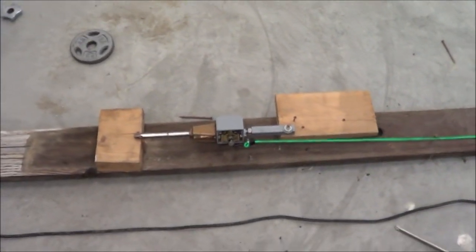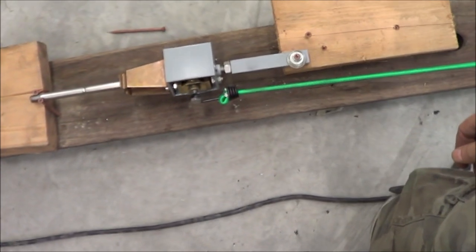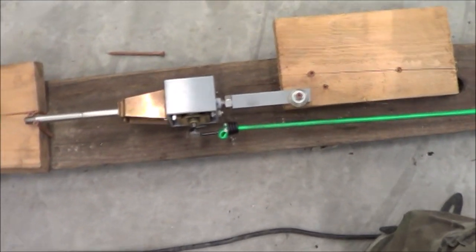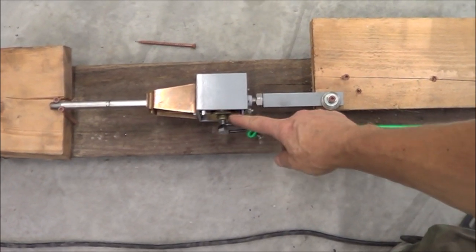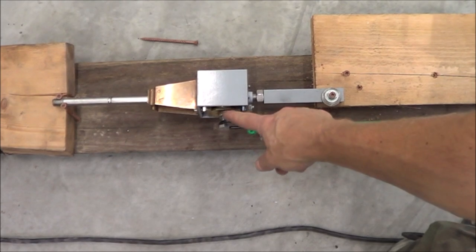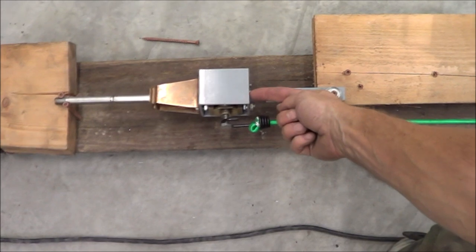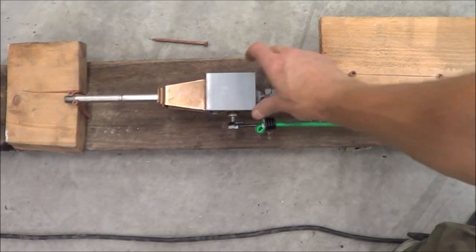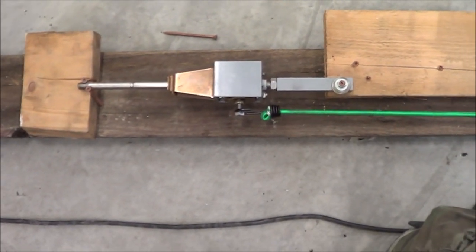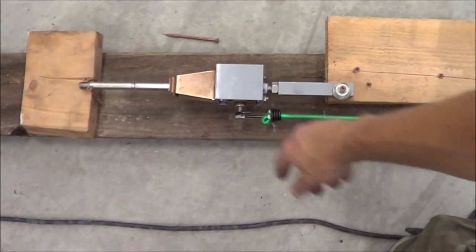Now, to be fair, this isn't 100% representative of the stock configuration. This bungee is hooked a little way out here on this bolt, where the lever on the bucket is actually closer in. And then the yellow bungee was hooked over the top of this rather than just poking in here. So that kind of increased its rotational torque as well. But it demonstrates the idea that the brake box magnifies resistive forces in the bucket arm.